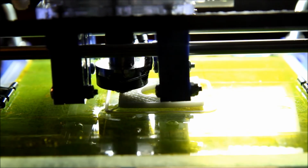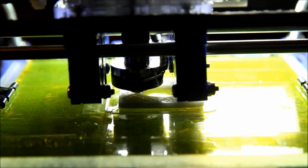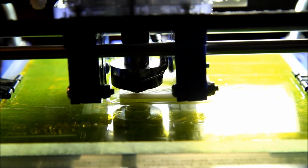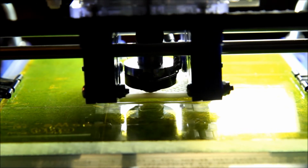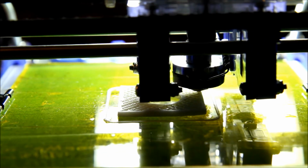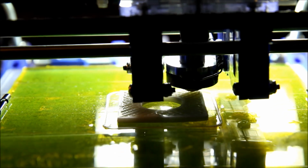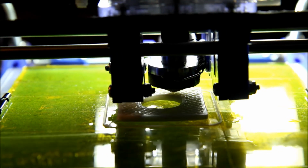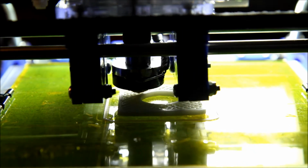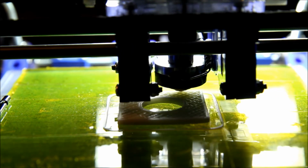I thought I was going to have that issue because I don't have the rollers hobbed or knurled, but it looks like, even though the roller looks like it's going faster than the fill rate, I get the sense that the roller is really just there to put pressure on the filament so that it will push through when it's moving. Working well so far. Stay tuned. We'll see if we get a full object. This is actually somewhat mesmerizing.